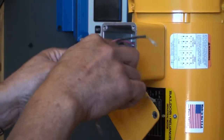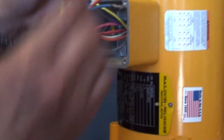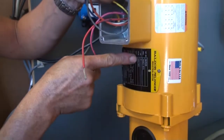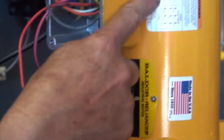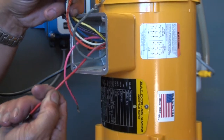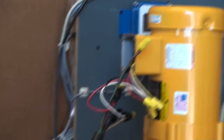Make sure you have the exact voltage, amperage, phase, and wire gauge. Please refer to the motor name plate to not only see the specifications but also the wiring diagram. Depending on the voltage you are hooking up to, choose the relevant diagram and hook the motor up accordingly. This electrical connection should be done by a qualified electrician to prevent any harm to the people and equipment.